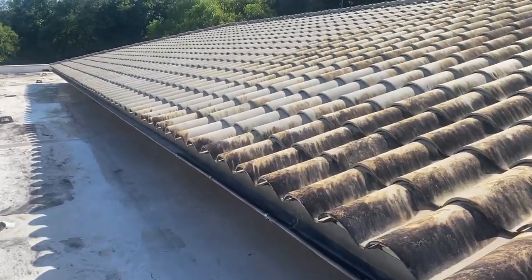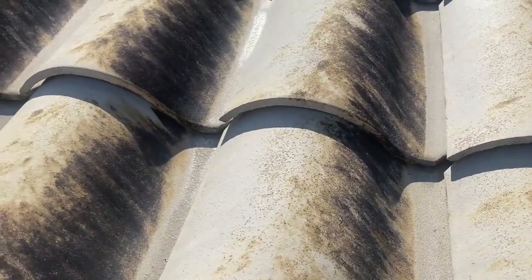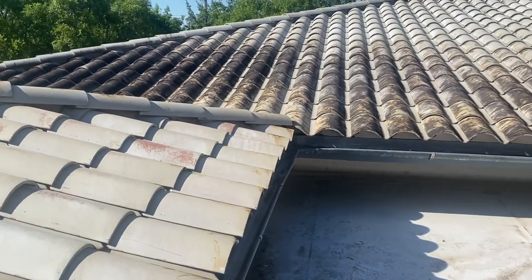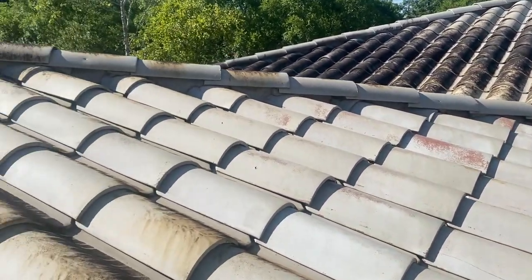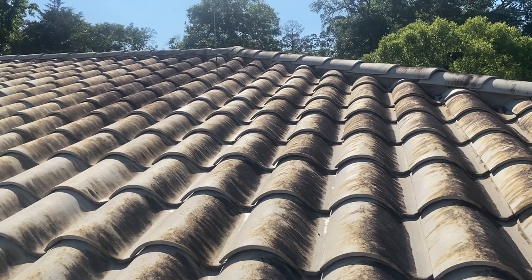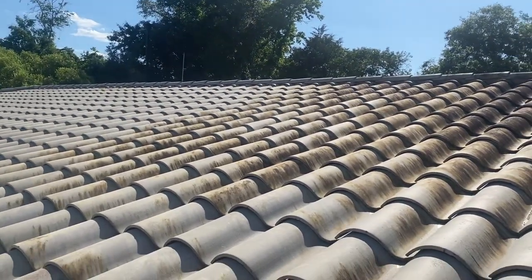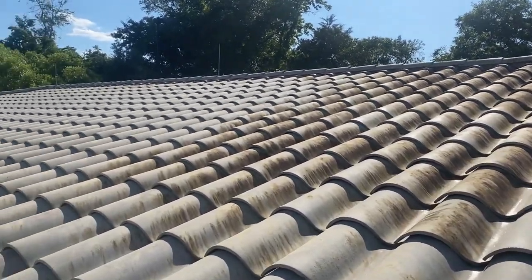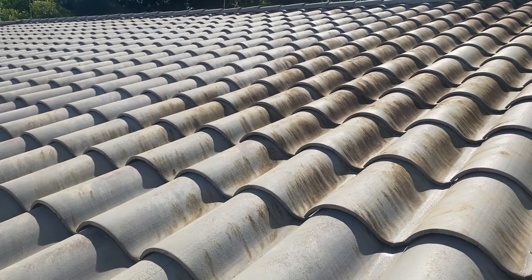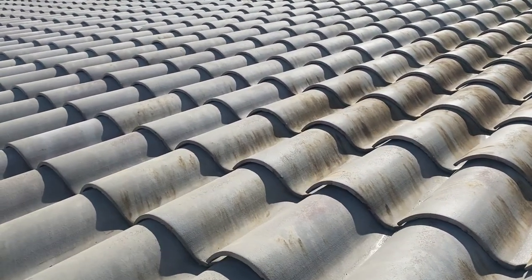So if you are walking it, it's really a good idea to be harnessed in on these. I know that sometimes it's a nightmare to figure out how to harness on these roofs. Some people actually go as far as taking a tile up and installing a D-ring harness into the roof, then uninstalling it and gluing the tile back at the end. I've seen that done before. Hopefully you'll get lucky and get a roof that already has tie-off points on it. I've actually seen videos on the internet of whole sections of tile giving loose and a whole section just sliding down.